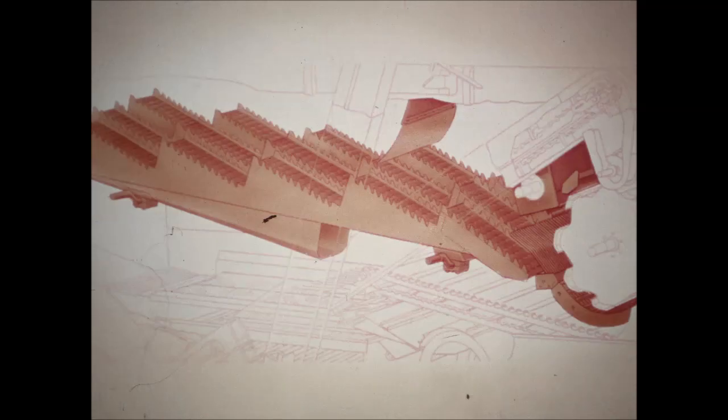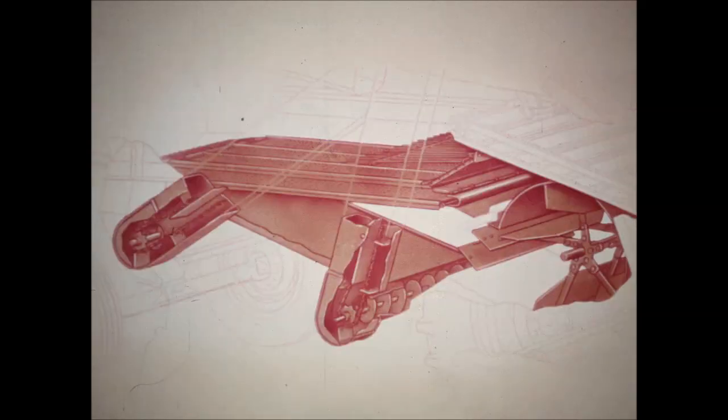In the separating unit, the John Deere 40 boasts 2,710 square inches of separating area and 3 all-steel 5-step straw walkers. Plenty of capacity to assure complete separation of the most stubborn crops. Here in the cleaning unit, the 40 self-propelled has 1,897 square inches of cleaning area. The full-width cleaning shoe and adjustable cleaning fan give you a fanning mill cleaning job every time.